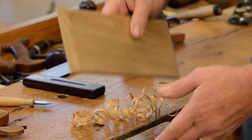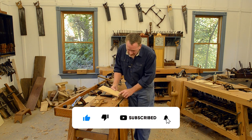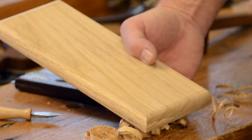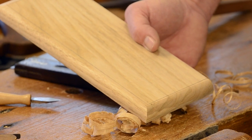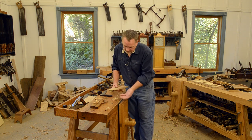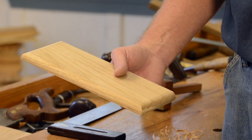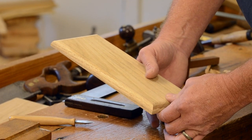So how do you know when you're done — when the two profiles kind of match? See right here where the two quarter rounds meet: when this line looks like a pretty much straight 45 down through there, that means both profiles are about the same. But here again, it's not imperative — get close. I wouldn't worry too much about that. I'll come back with a little bit of sandpaper and knock all the sharp corners off anyway. So if that line's a little squiggly, I don't worry about it. But these look pretty good — we've got a good straight meeting point there.